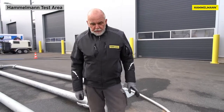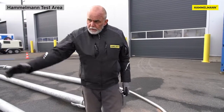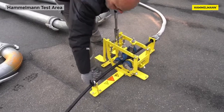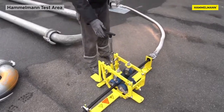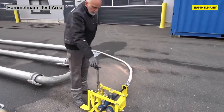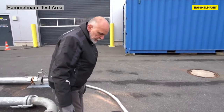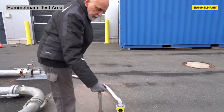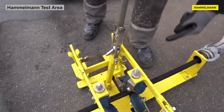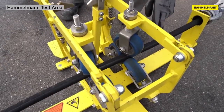Here we are at the feed unit, or feed and retraction unit. Our rotating high-pressure hose runs along here under pressure, is secured here, and then continues through these pairs of rollers. In order to implement the feed via the rollers, the feed is switched on here, and the hose is given a twist by the interlacing of the rollers and the clockwise rotation.